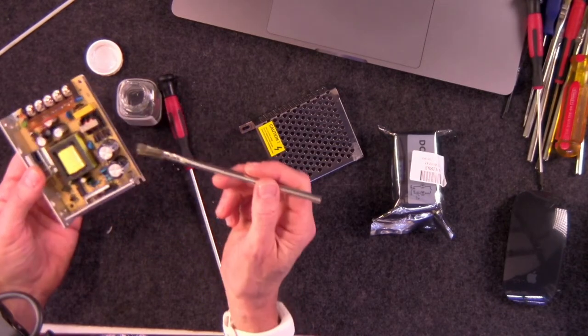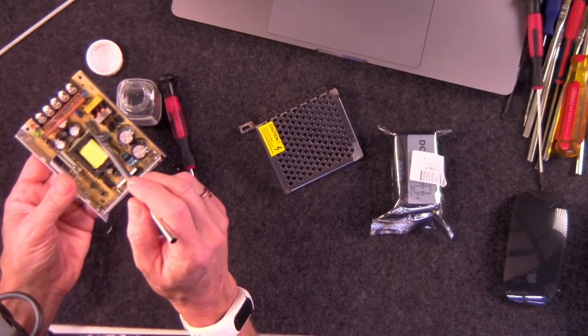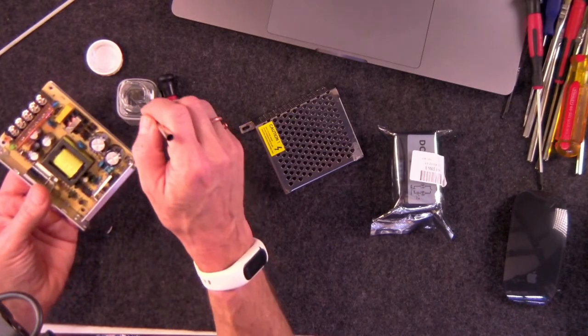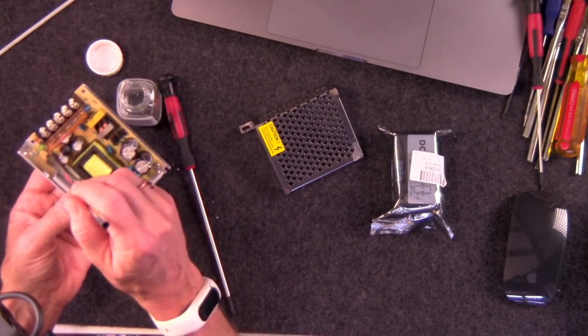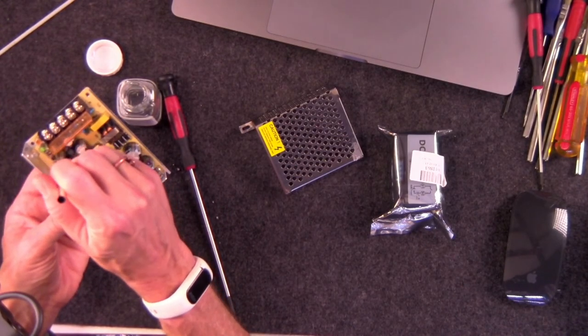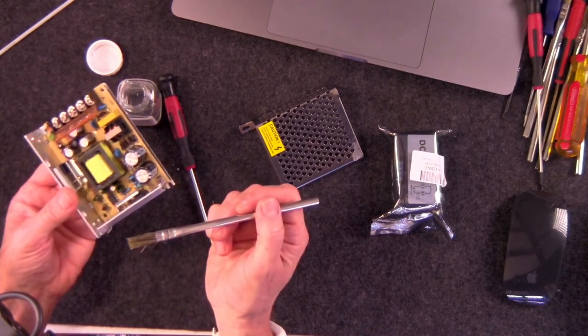And you do want to stay away from anything that's removable, like a fuse or anything. Now, this fuse is not removable, so I'm going to go ahead and cover it. But anything like a removable fuse, you want to let go, so that you can still remove it later. But otherwise, go for it. Dab it on there. Make sure you get it good and wetted down there. And you'll see it's a solid layer.